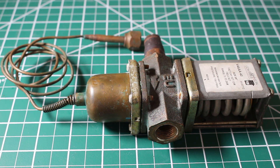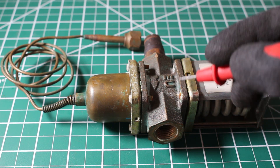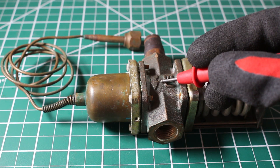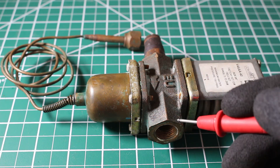This is specifically a two-way water regulating valve. As you can see, we only have two connections. Please pay attention to the arrow — this is important. Water regulating valves are used in water-cooled air conditioning and refrigeration systems to maintain the head pressure, and we do that by regulating the amount of water that we let go through this control.